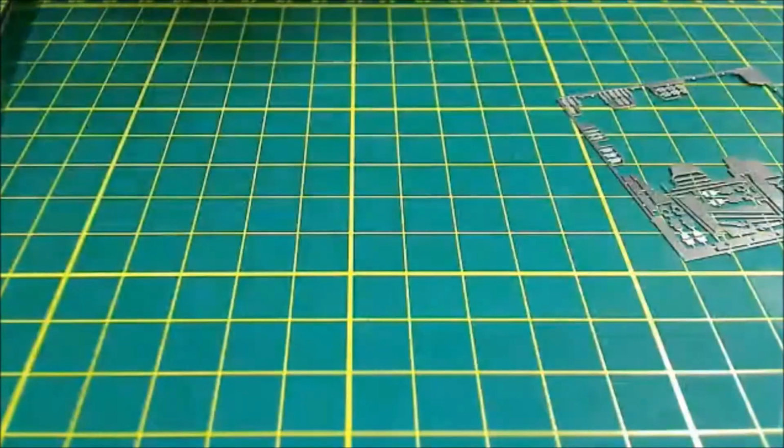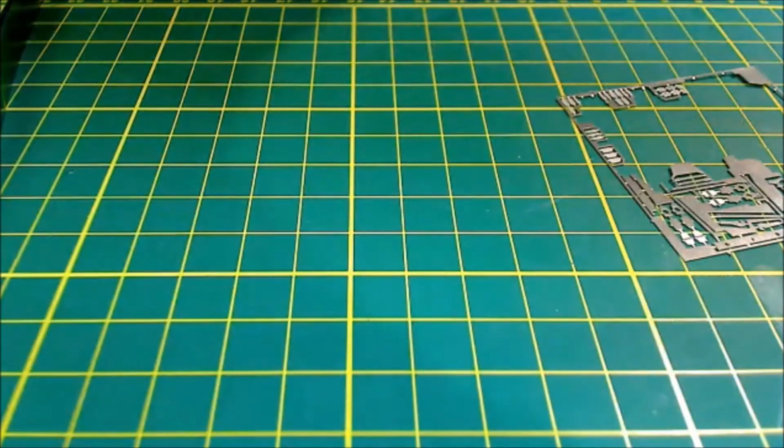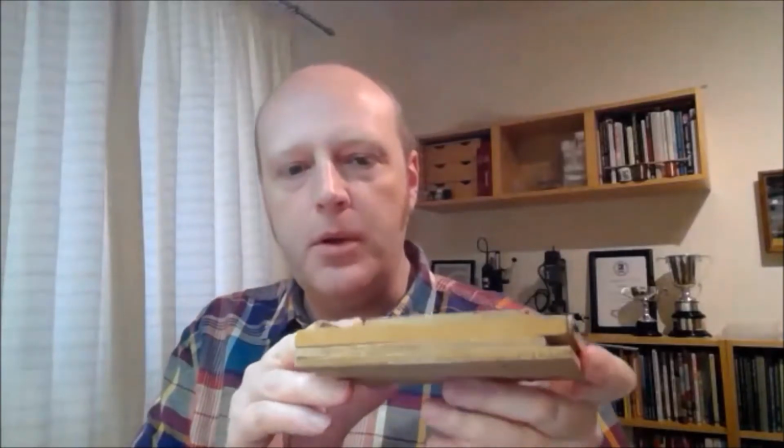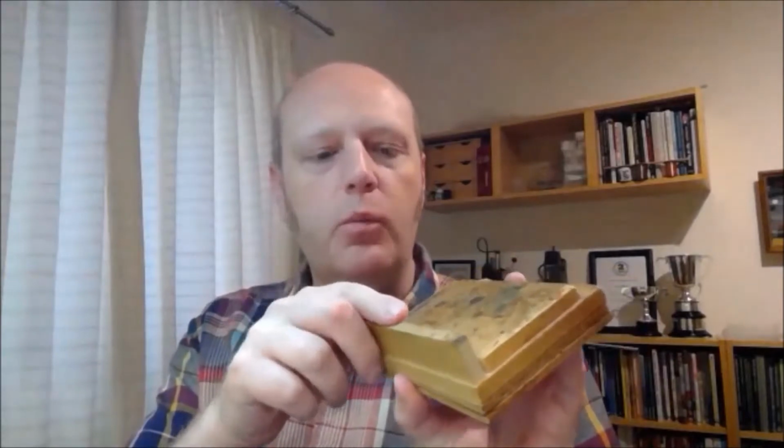But I have a special jig for doing this, and it's one that I got from David Evely, an association member. He's not with us tonight that I know of, but it's called his Orion jig. And it's very simple to build. He built this one for me, but you could build one for yourself. A couple of layers of board, a thick sheet of MDF on the top, and some vertical bits of wood, top and side, to build things against.